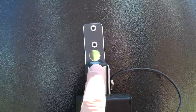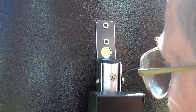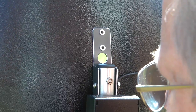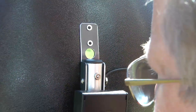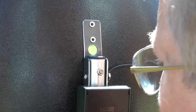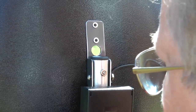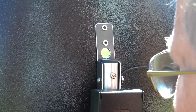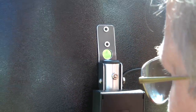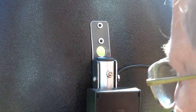Here's a closer look at the sight hole. So I look through this hole right here, and squint with one eye, and then what I'm going to do is look through the other hole. And that's going to be my window that the dish will amplify the ultrasonic sound. And so you aim at individual pieces of hardware on a pole, or maybe an electric fence, and by looking through that hole you can get to a very, very close proximity of where the troublesome arcing source is.